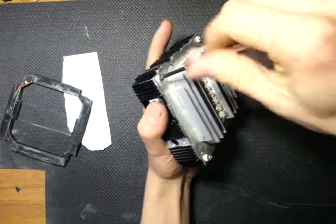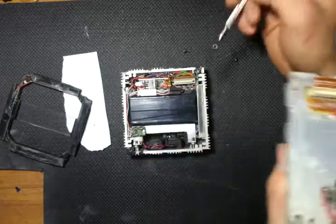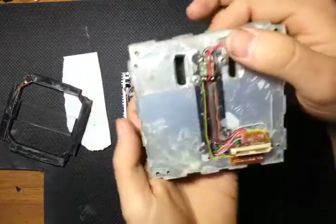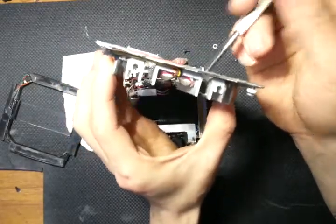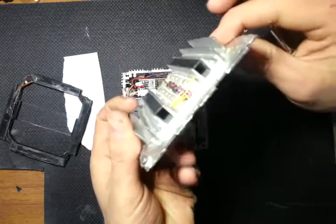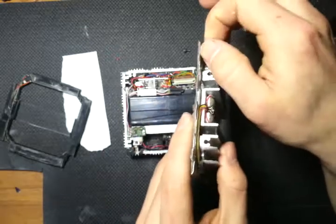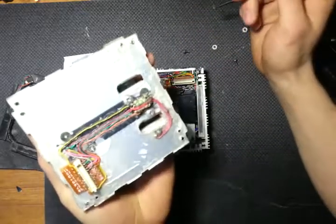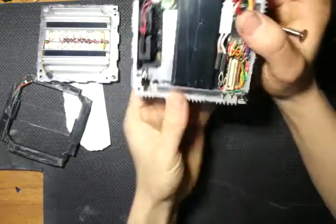I think some of this needs to be re-glued too. On the bottom side, you'll see that I have a docking port that docks into this area here — all my little wires and stuff like that, my screws to hold on the heat sink. You'll see two cutouts here; they're kind of clear. What those two cutouts do is blow air from the fans up and through these slitted entryways, which help cool down the LEDs for the continuous use feature of this light. It's about 30 watts of output power, if not more, when in full use, and it can be connected to an external power source, which gives it almost infinite use life.